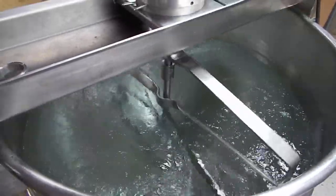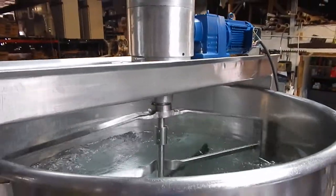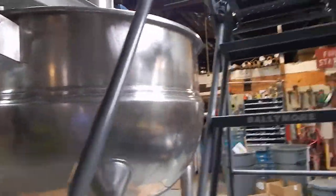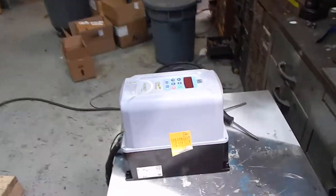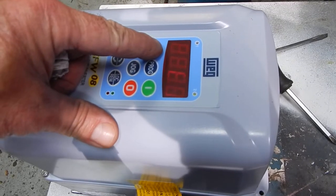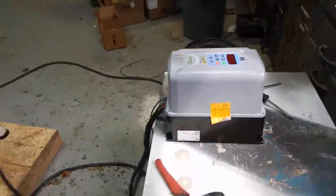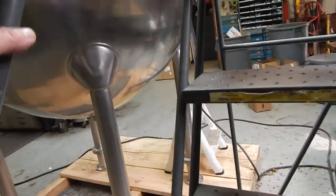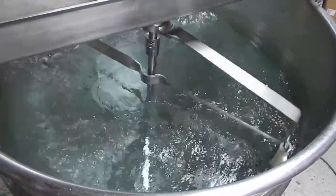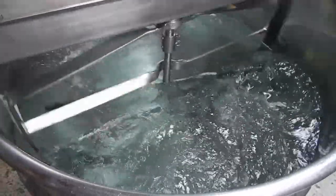Nice smooth operation. We're going to be operating this through a WEG AC frequency controller which will operate on 440 volts. We're testing the controller that's going to travel with it right now — I hope you can see the numbers there. We're going to just go up. We actually set this up to run a little faster than the factory calls for, since with the controller you can always run it at any speed, and sometimes for cleaning or some other reason you may want a little bit faster speed, or maybe there's some tough mixed products that that helps with.